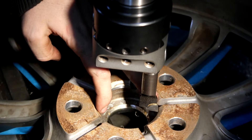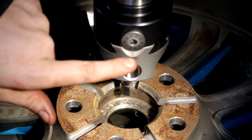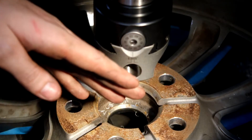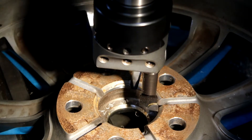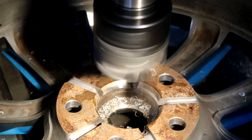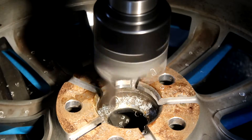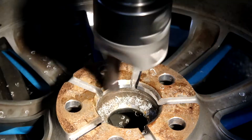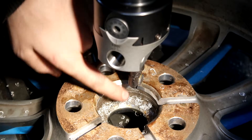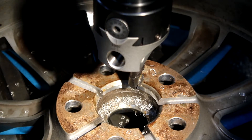I'll measure this diameter now. Let's say I need to go 5mm bigger — I'll have to convert 5mm to imperial, then wind the cutter out 5mm. Not 5mm at once though — probably 2.5mm and then 2.5mm. Before measuring, I've decided to rough it out a bit more, because there's a lip hanging over and the diameter I need to get to is that bottom diameter. I'm just taking off the bulk of the material before I start measuring.